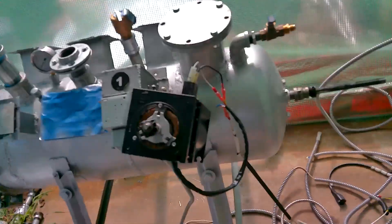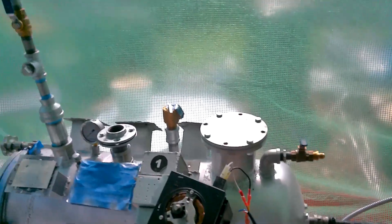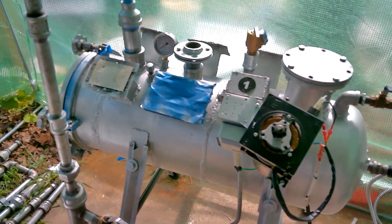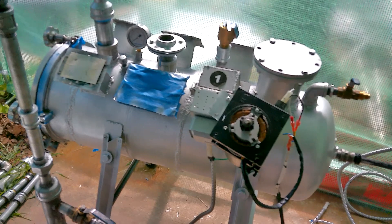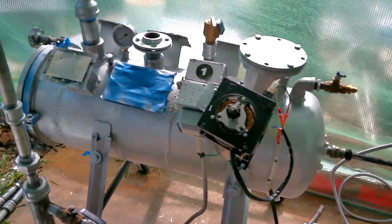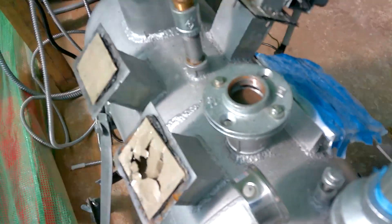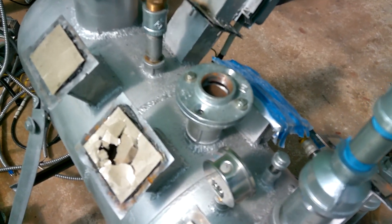So there was some type of pressure explosion, and I'm not sure from what. I know these pipes aren't the biggest. I think what's happening is — if I open up this chamber right now there's a crazy amount of vapor in there. The microwaves start to heat up the vapor, vapor becomes very hot, it starts to expand even more, and it can't all get through this water bubbler. It creates a ton of pressure. As we can see in terms of damage — this was damaged, all of the mica sheets are bulging and poking out. But other than that, no damage to the chamber, no damage to the pipes. The pressure release valve did not open, so it wasn't an obscene amount of pressure.